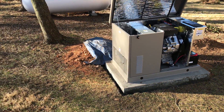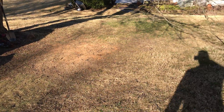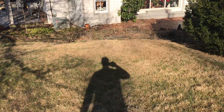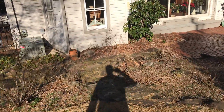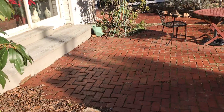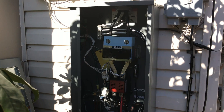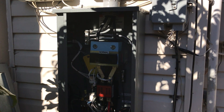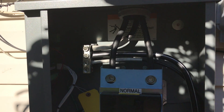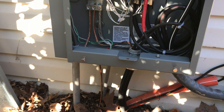This system has been installed and we're waiting for an inspector right now, so we can't bury our trench back until he looks at it. We have the doors off. We dug over here to the home. The transfer switch is a basic 200-amp whole-house unit with an overhead electrical service. We mounted this unit outside because the house has no room inside and it's at the back of the house. We came down out of the bottom of the meter, ran our service cables in, and everything is made to factory spec, then we run the generator wiring and all other piping up.